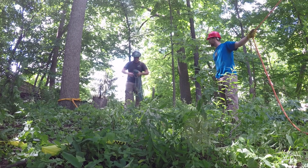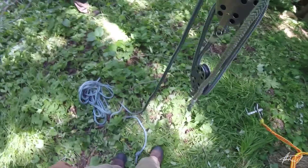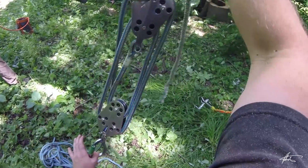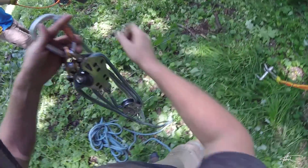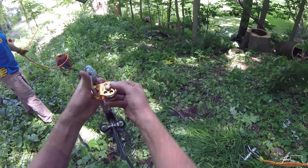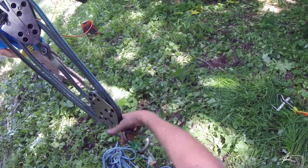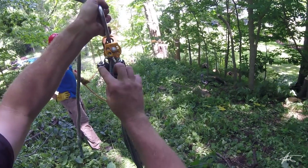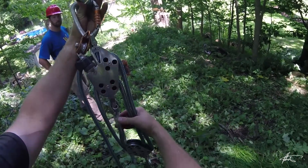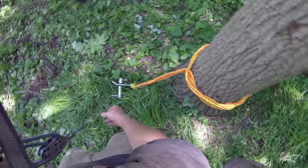So if you've put it away properly, it's going to be stored like this in what I would call the fully retracted position — this is as small as it gets. It requires a carabiner on either end as well as an eye-to-eye, and I like to throw on a micro pulley as well. This is the anchor end here, and this end with the cleat — where you pull from — this is the forward end. This end faces towards the load, and that'll give you your 5-to-1.